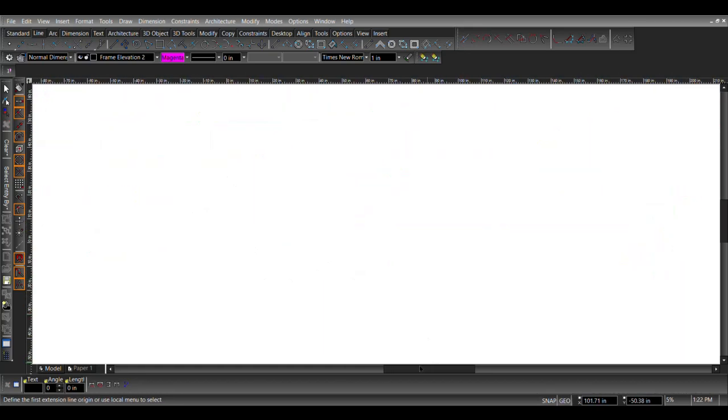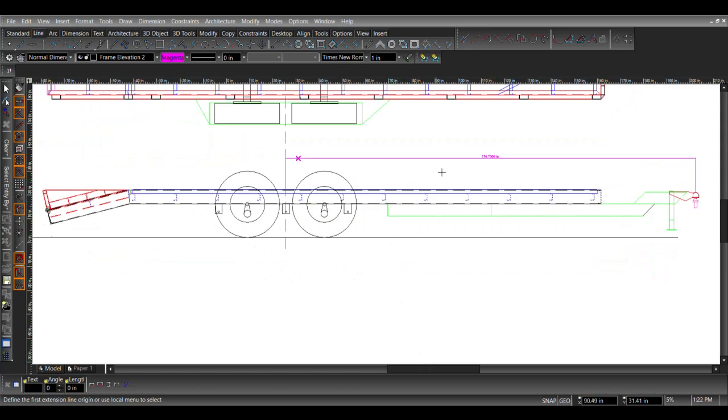There were some discussions about why I went with a 5,200-pound axle. The pickup I'll primarily pull this with for heavy loads is my second-gen Cummins Dodge. It comes factory with a class 4 receiver hitch, which is rated for 1,200 pounds tongue weight and 12,000 pounds total towing weight. It doesn't make sense to build a 15,000 or 16,000-pound bumper-pull trailer when that would exceed the class 4 hitch rating. This trailer, with its capacity allowing up to about 1,200 pounds on the ball, fits well within what the class 4 receiver hitch is rated for.